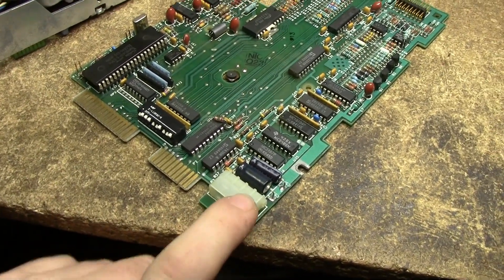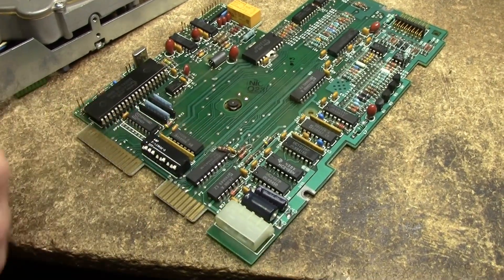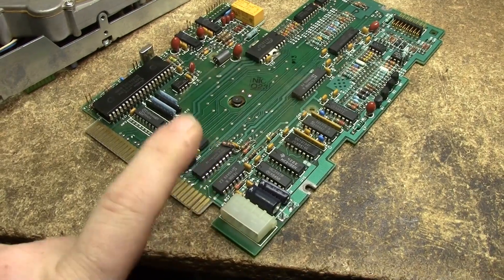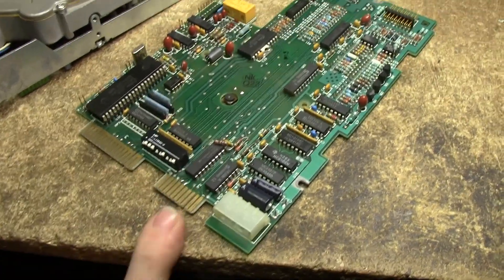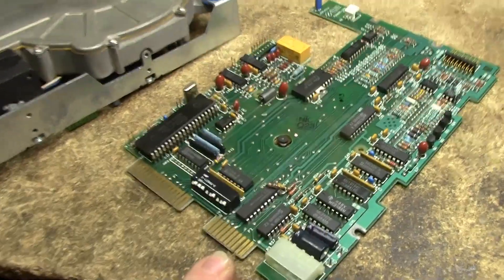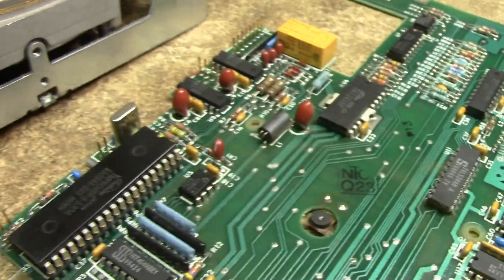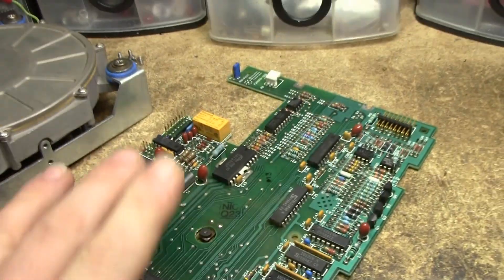On evaluation, I discovered that one voltage rail is about 76 ohms, which is fine. The other side is 17 ohms — that's a little more concerning. I'm assuming it's actually a dead short, so our problem here is that we have a shorted tantalum most likely hiding somewhere on this board.